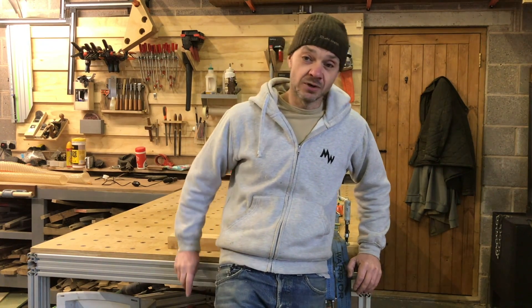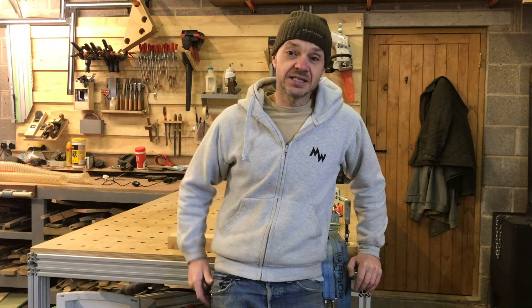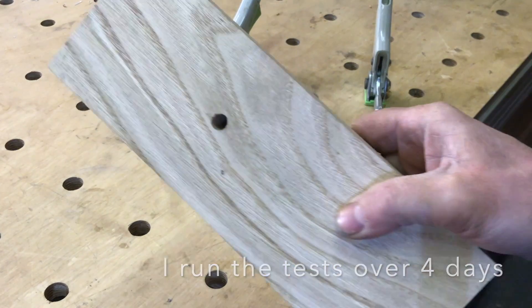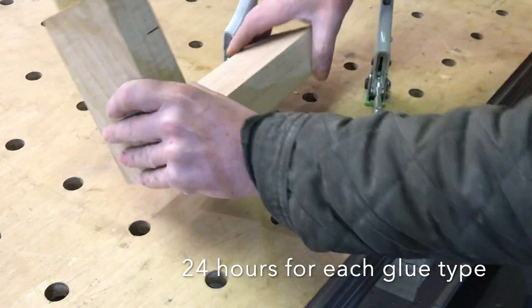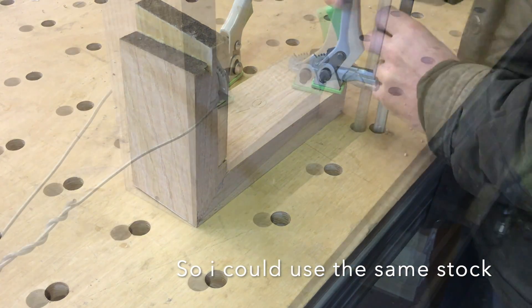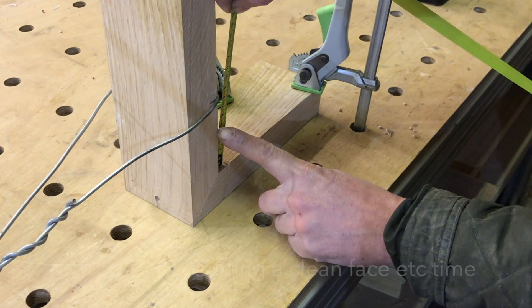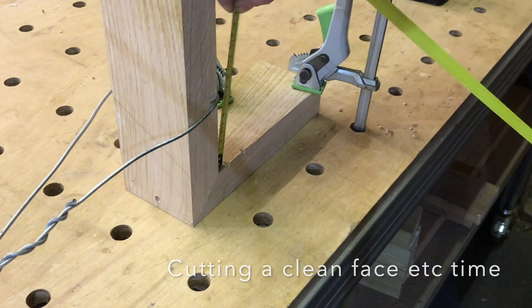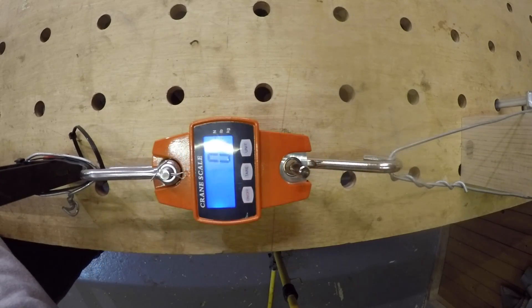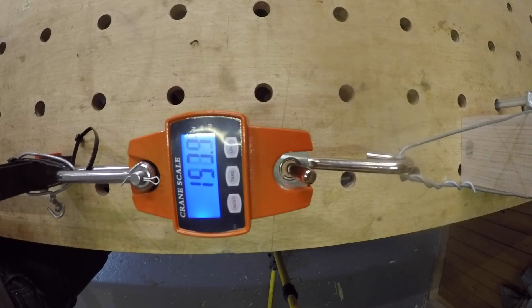It's so quick to get the perfect mitre. I was interested to see how strong it was and if it added strength. There's no doubt it makes the mitre perfect every time, and really quick to use - quick enough that you can glue a whole table using ET500 with a single nozzle, the whole table leg system, under five minutes, which is just not possible using clamps. The last test with the pressure was at 50; these are now at 80. I ran the first test with the Domino and Tenso with Tight Bond 1 as a reference.